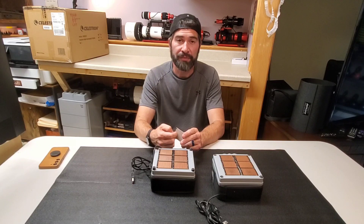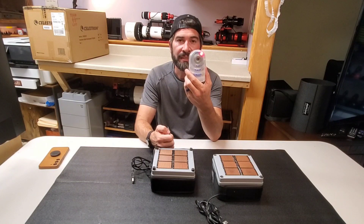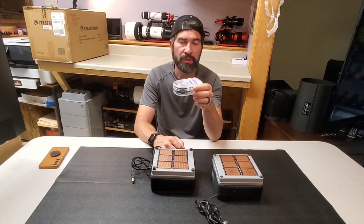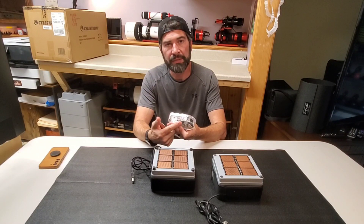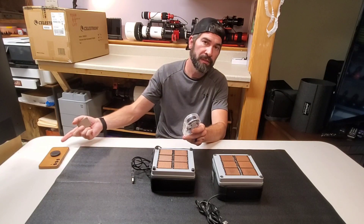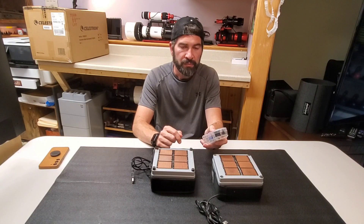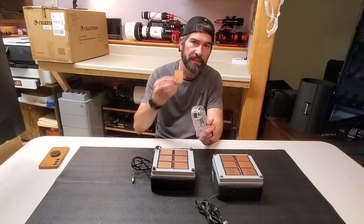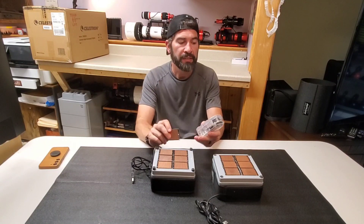I wouldn't say luckily, but that same week my downstairs sink overflowed and dripped some water on the floor where I had one of these — a water sensor for your house. You place it on the floor, and if your water heater breaks or any kind of sink backs up, the water touches these two metal pieces sticking down, completes the circuit, and triggers the alarm. It's also connected to my Wi-Fi and sends an email to my phone. When that happened the same week, I thought — these only have two little metal pieces sticking down; I wonder if I could attach panels to them so that touching water triggers the alarm. And it worked.